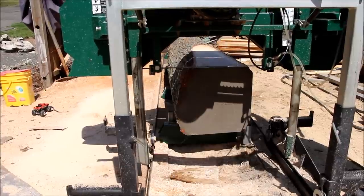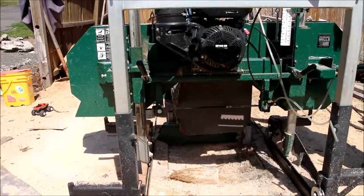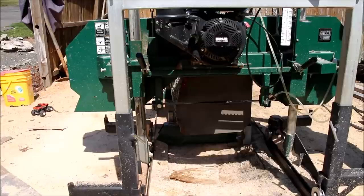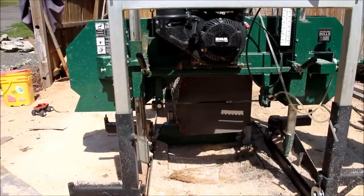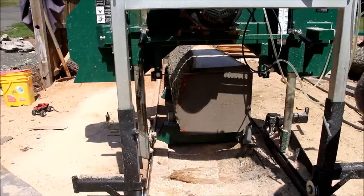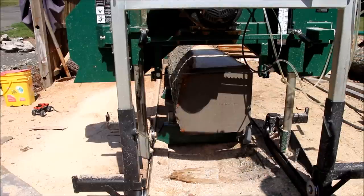So let's go all the way down to the center. So that's about center. Now we got 4-4, so 4 turns. 1, 2, 3, 4. That gives us a 4-4 board above center. And then we go up essentially 7 inches. So we're at 9.5 right now. We're going to go to 16. Okay. So that right there might actually yield us some usable lumber above that.